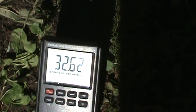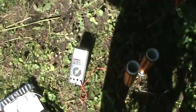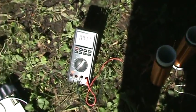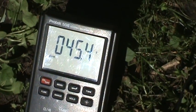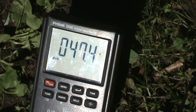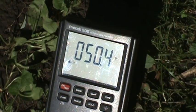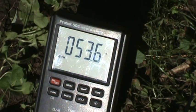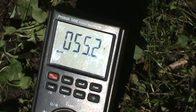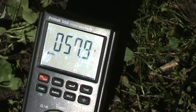And you see we're at 30, 31. Let's get that screen back in there — we're at 42, 43, 44, 45. Now I'm actually getting concerned about my components. They're only rated at 50 volts. 55 volts, 56, 57 — we're still going up here.